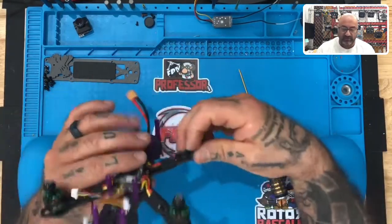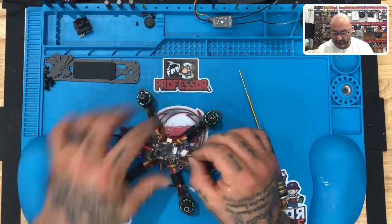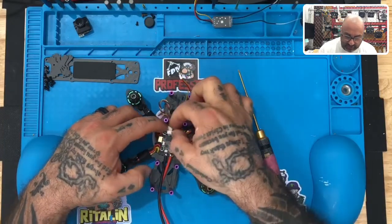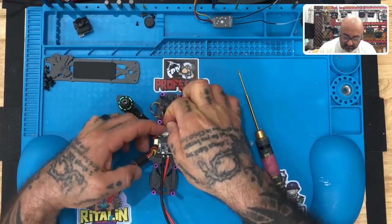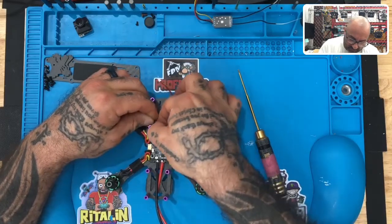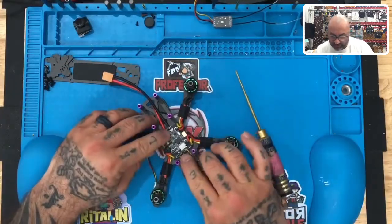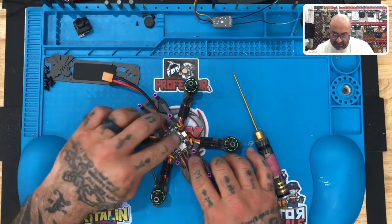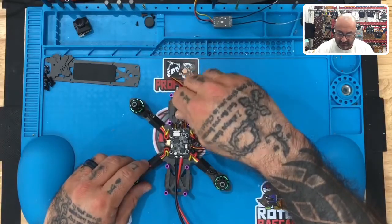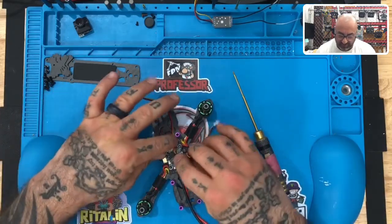So what we're going to do is take a second to plug this in. Based on the way we mounted this, if your drone is facing away from you, the blue cable will go all the way to the left. So if you turn your drone to face you, you would have no wires on the first two plugs on the left, and the farthest plug on the right will be the blue cable — it looks just like this. And if you'd like to tuck these wires away now, you can gently just twist that up and lay it right here and it's perfect — this will stay perfectly out of the way.